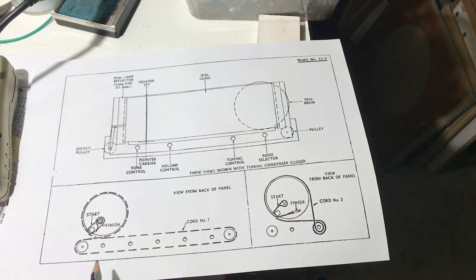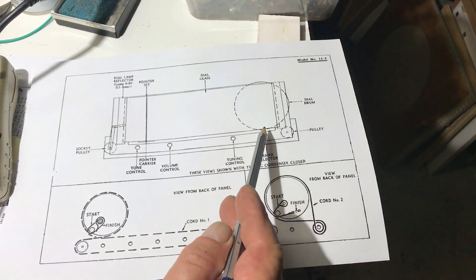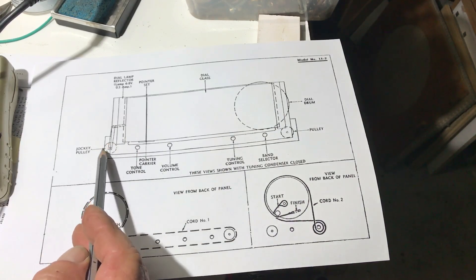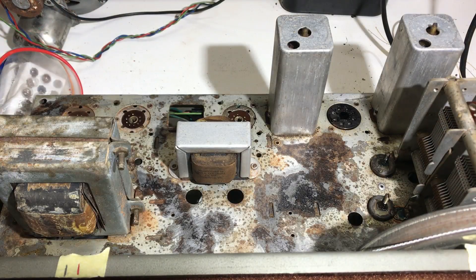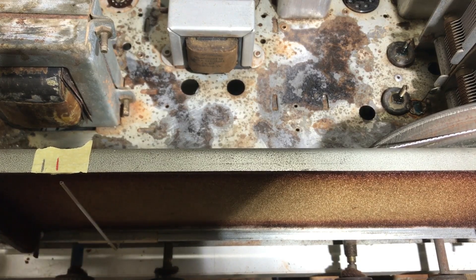So I've had to do it a different way. I essentially go around here, along here, over the fixed pulley, and diagonally back up over the drum - I had to do that to get the direction of travel right. There was a break in the dial string but the rest of it was in pretty good condition, so I simply replaced the section from the pointer around the pulley and back up to the drum. The rest is the original dial string, which is in fine condition.